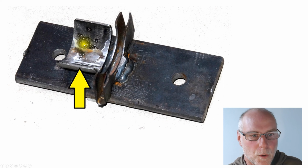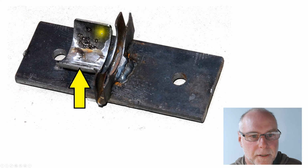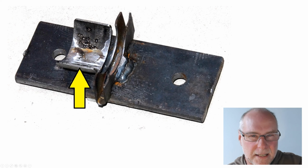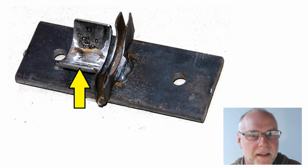The base plate, as with the vice grips approach, uses the bottom half of a muffler clamp that I've just welded to the base plate, and the arrow points to a semicircle of tube which is slightly larger than the tube you'll be using, and that means that you'll always line it up square with the tools. If you don't have that piece of tube, it's easy to make the tube not go in square, and that means the bead will wander around rather than being perfectly parallel with the end of the tube.